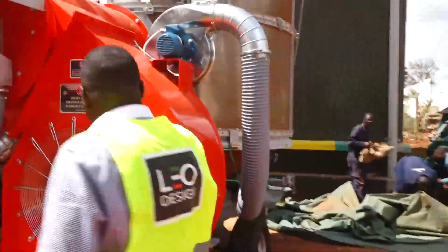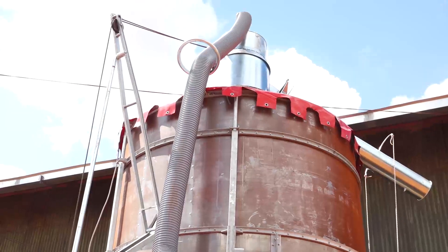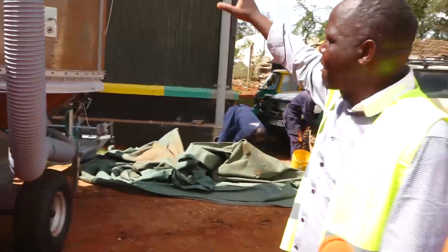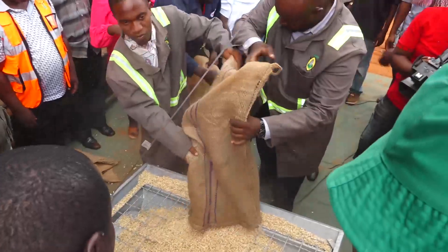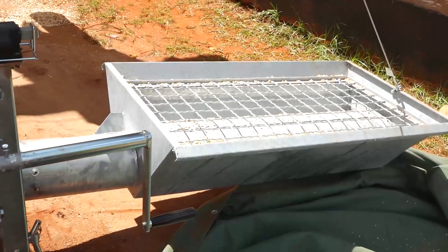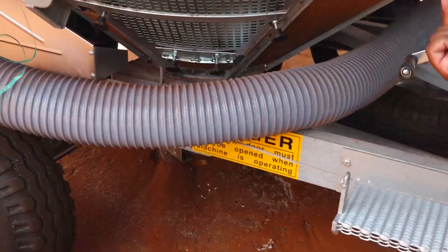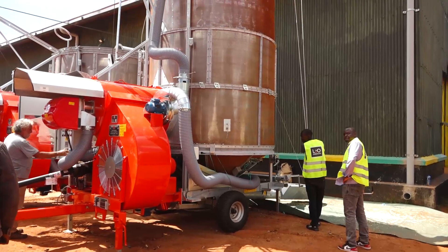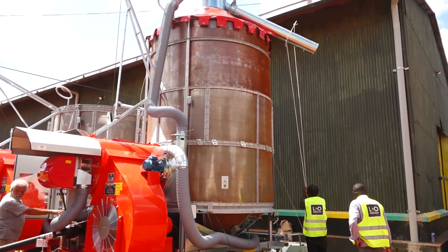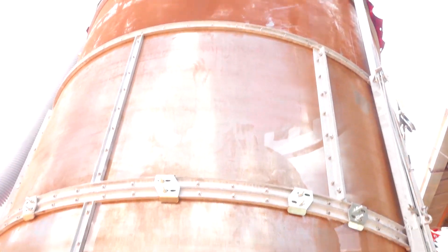This is the fan which basically blows the flame into that big container there — that big container is where the grain goes. We load the grain into that basket and there's a shaft inside called an auger which goes round and pulls the grain down this pipe into the central point. There's another one called the main auger or central auger that goes all the way up and takes the maize through and inside a cone. It fills the space between here and the inside cone, and that's when the flame comes in and hits the grain.